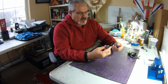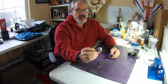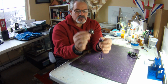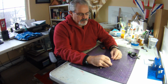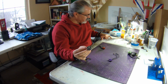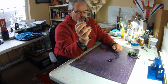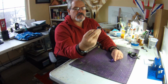Alright, so we actually have a bit of a tie for second place. This is the B-Rotor Z2207 2780 from RC Timer. Comparatively, these two are very close in top end speed. The other is the Brother Hobby Returner R2 2205 2800 kV. These are both really well made motors. The B-Rotor cost me $16.99, weighs 50 grams, 1.8 ounces, and draws 32 amps at full throttle on 3-cell with the prop. So it's the torquier of the two, but it's heavier, pretty much equivalent top end speed.